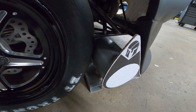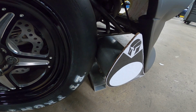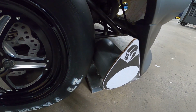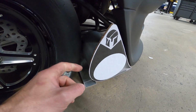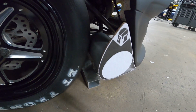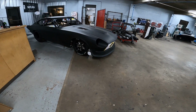And it's going to have to go to the front of the car, maybe, I would say probably a safe 30 degrees or so. We're probably going to do it 45, just so we get it going in the right direction, and then we can build our pipe to it, and then we will make this tip match the offset center line there. So let's make another mock-up piece. I think we got it now.